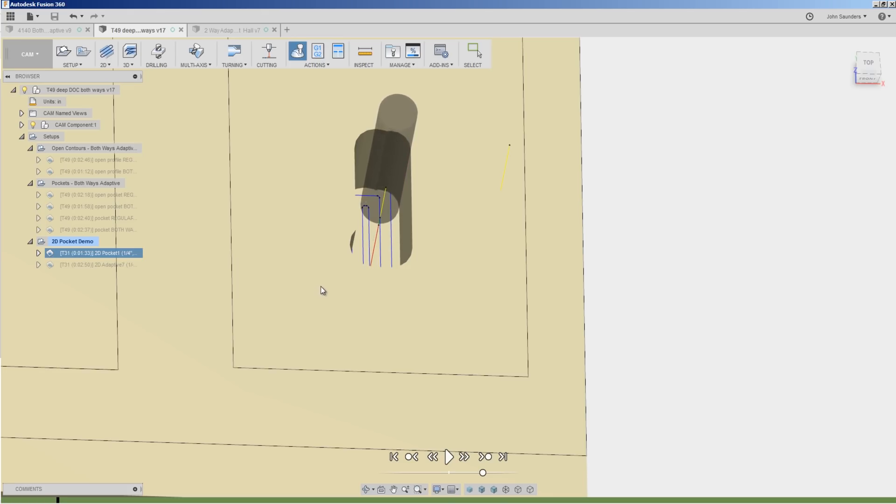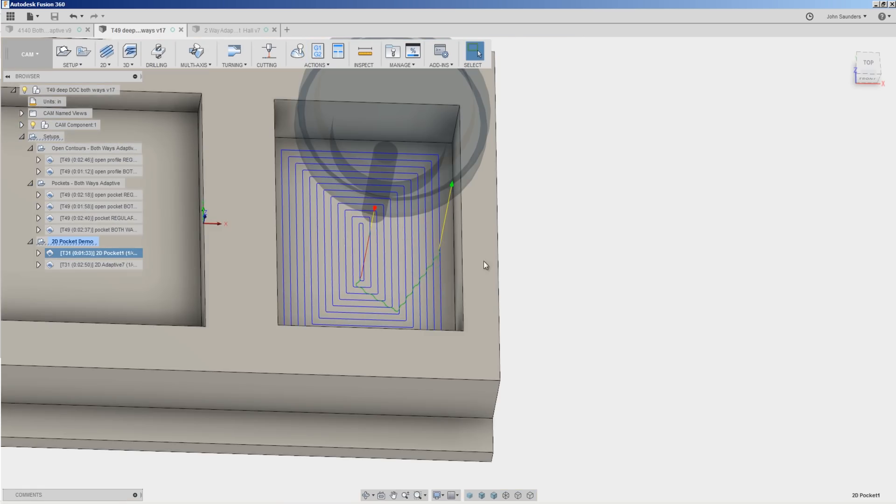The problem is those corners. As we move into the corner, the amount of what's called the tool engagement angle — the tool is now cutting from over here all the way around to here, whereas if you rewind a second, the tool is just cutting on a relatively small portion of the cutter face. This has a lot of implications, ranging from tool deflection, horsepower requirements, chip evacuation, and process reliability.